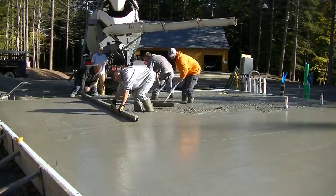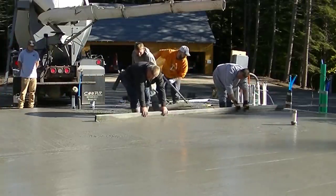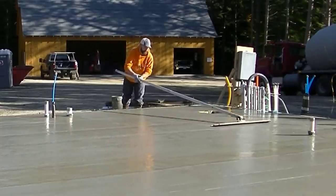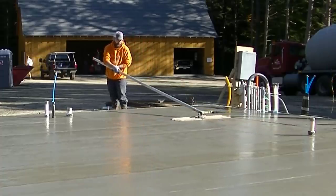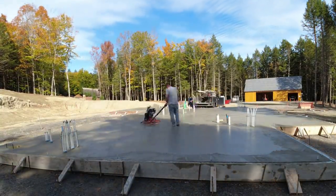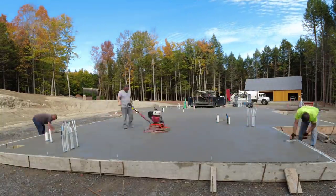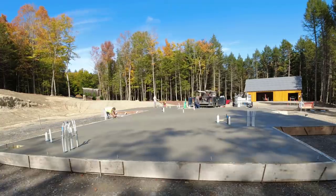It was a little trickier trying to kick-screed this concrete at 10 inches thick while dodging the rebar that's up in the slab about four and a half to five inches. Javi's going to finish up bull-floating, we'll get all the tools washed up, and then I'll show you how we got this thing power-troweled. Here we are, about an hour after the pour — you can see the shade on the very first part we started. Darren is floating everything else, using the MBW 36-inch high-torque trowel that you've seen on some of my other videos.